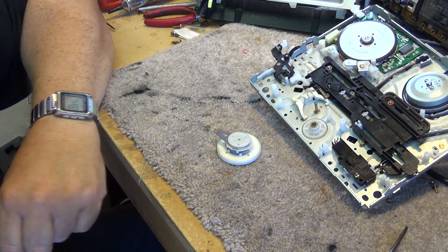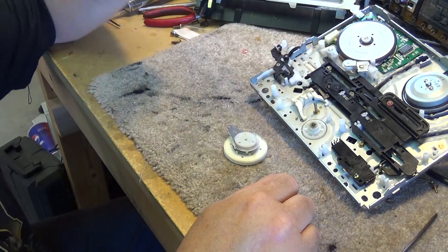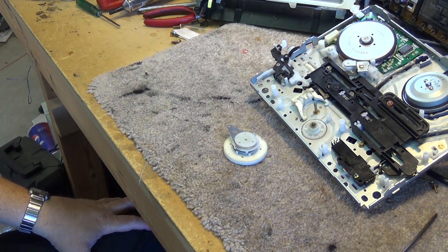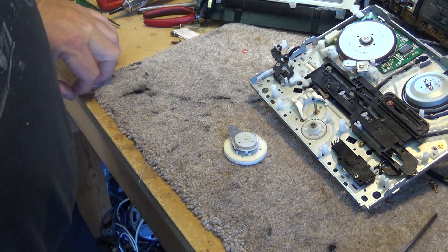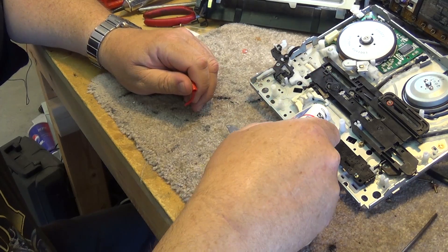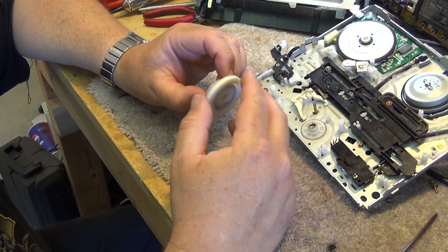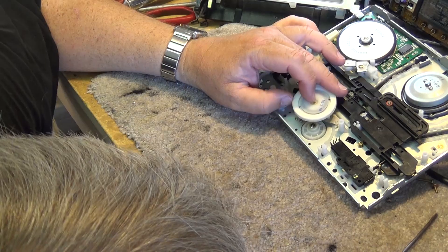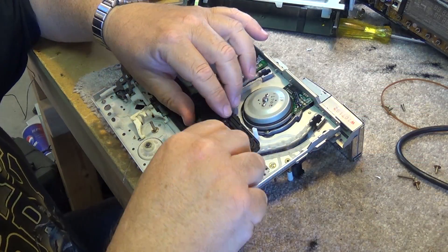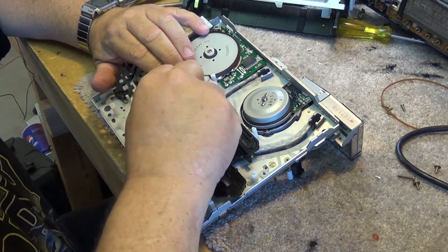We'll use a good old molly lube - just a dot of this stuff is all you need. Just a dot is sufficient because as this rotates it will lubricate. Now we take the clutch assembly and put it back together into the main gear assembly. Then we take our top portion of the clutch - there are two springs in here, one inside the other, so it's best if you just leave it on your bench and sandwich the whole thing back together. Push it back together and it will pop into place. Now your clutch is back together. The two springs serve different purposes: one applies tension on the clutch sandwich assembly, and the other pushes the secondary high-torque clutch back out of the way.